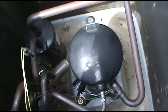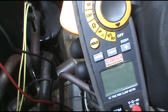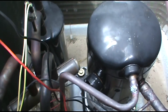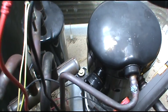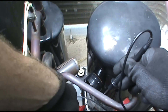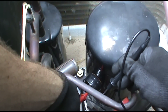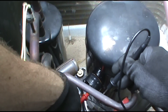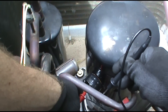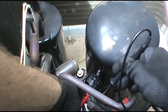Break the meter out and I'll show you another way I double-check. After I've used the Supco Megger, I set my meter to continuity and touch one of my leads to the copper pipe, and then one to the winding prongs — or the pegs on the compressor. If it beeps, your compressor is shorted to ground. Yep, hear that beep — start winding. No beep on run, no beep on common. Just the start.